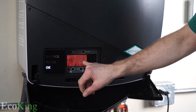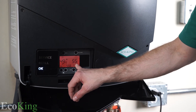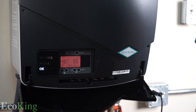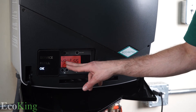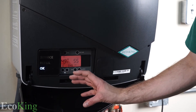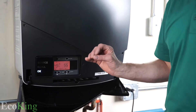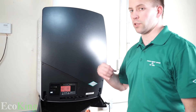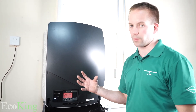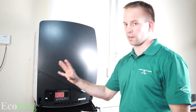By itself, it's dropped to 55% power. You want to watch this temperature — that's the supply temperature going out to your heating system. The most essential thing is you must have the zone valves open, your thermostat on, and your external pump on, so the heat this boiler is producing can go into the system.